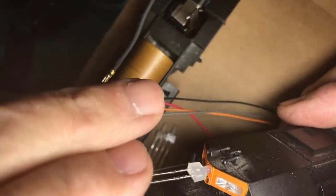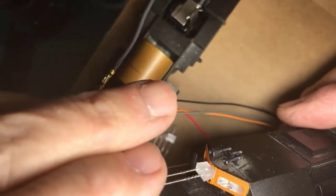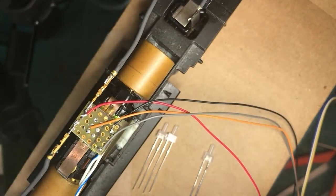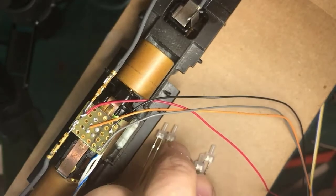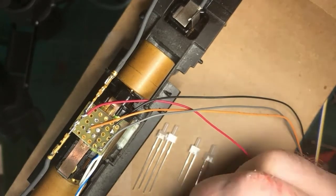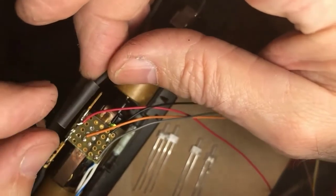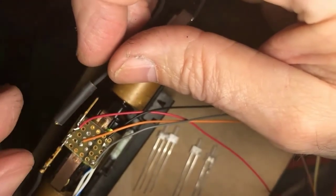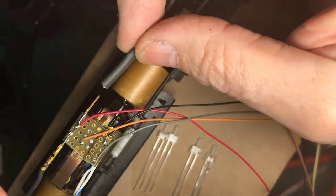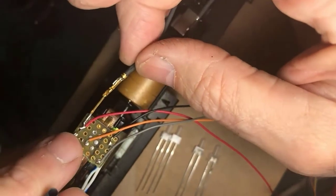Now I'm going to have to do some cutting of plastic, I think, out of the inside the shell for this top one here. But this is what I'm going to be installing in the shell. I'm going to wire way out in the open, though, so that I can cut the lead short when I go to do a clean job. Oh, speaking of clean jobs, this guy here, not today, not right now, but I will heat shrink these guys to minimize the chance of touching something like the flywheel and shorting out in some stupid way. But for the moment, we'll leave them bare.